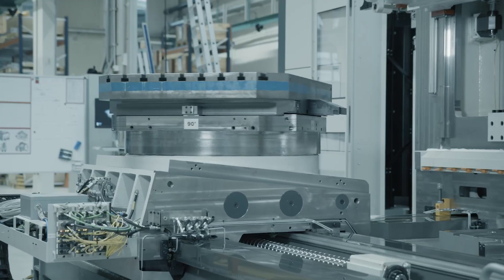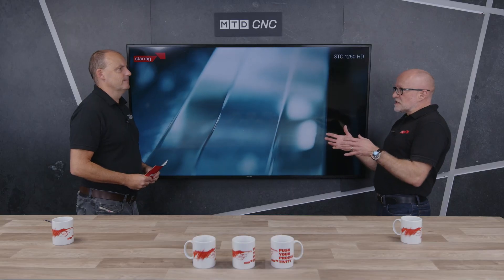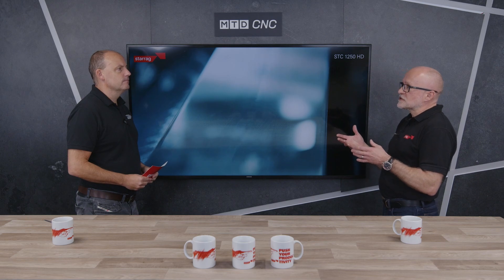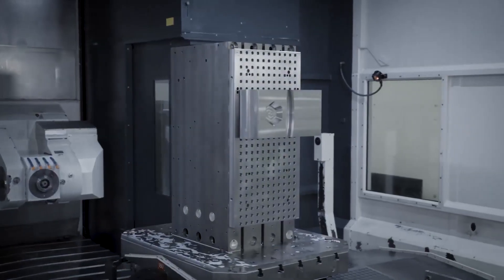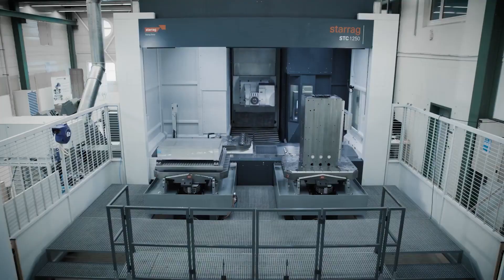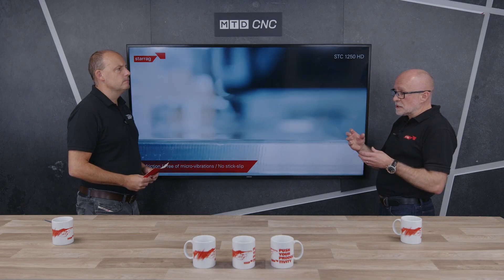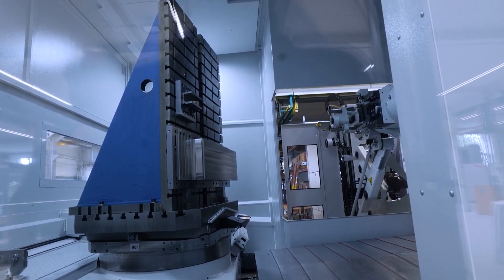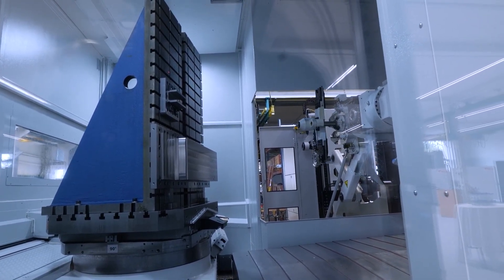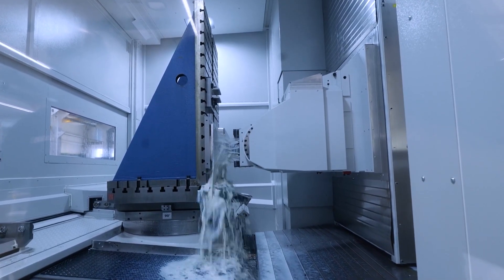So what has changed — what does the HD mean? Well, I'll tell you what hasn't changed for a start. The head configuration hasn't changed. The head is a very stiff, rigid but compact head design with a range of spindles, but for what we're going to talk about today specifically — gear spindles. We have a drive system in the spindle; the spindle itself is a gear-driven spindle, HSK 100. We also have a dampening brake so we can lock the spindle, stop it to swivel for very heavy roughing, but we can also dampen it in 5-axis mode. So very efficient and heavy-duty capability from the head — and versatile.